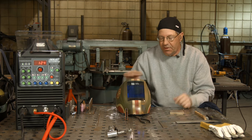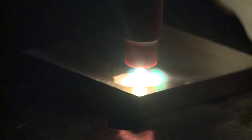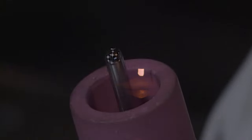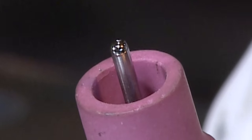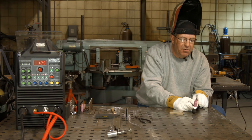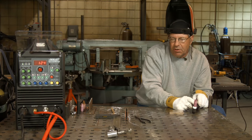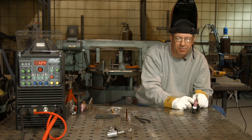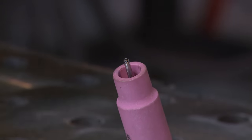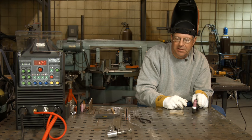I'm not even going to put my gloves on for this — I am going to put my hood on. Okay, this didn't take very long at all. I really like doing this on copper better, but same effect — this came out nice and shiny. It's clean on the end and now we're ready to go on aluminum. We'll do a quick demo shooting over the top of some aluminum. We'll set it up on 60 cycles per second, alternating current — nothing fancy, no pulse, no nothing on the machine. Just old school AC TIG.